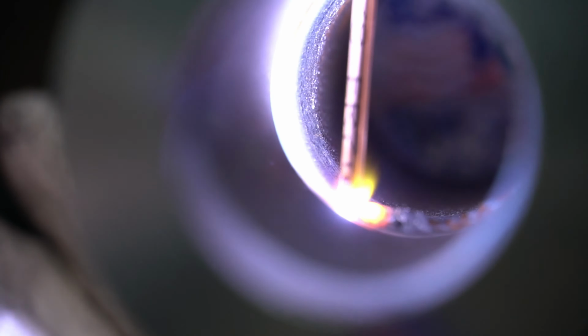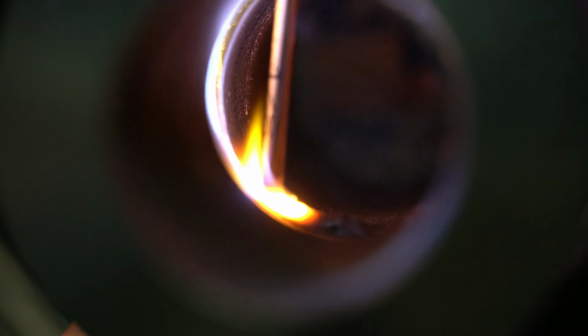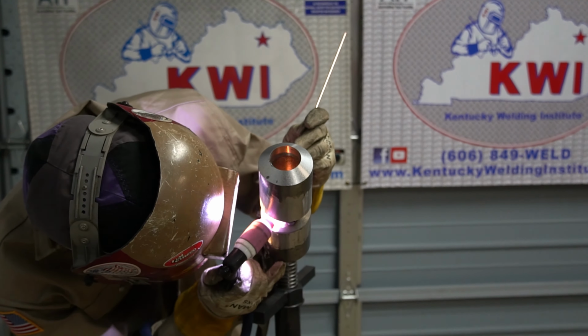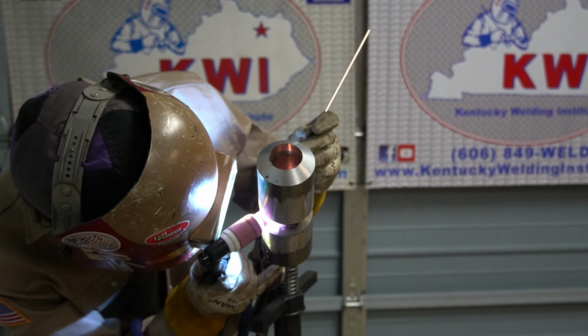And since we're on my right-handed side, I will almost always brace my TIG hand with my pinky or a TIG finger or something, so that I know I'm a little bit extra stable. Also, when I'm moving up through this bevel, I make sure my tungsten is nice and sharp and always clean, and that way I can avoid trapping anything dirty. I just take my tungsten and go from the top of the bevel to the bottom bevel, back and forth, making sure that I'm feeding a consistent amount of wire, so that I get a nice, even, pretty-looking bead going through there.